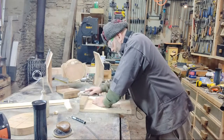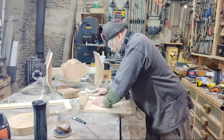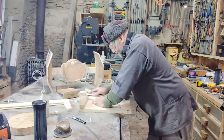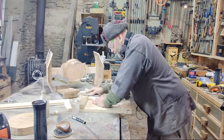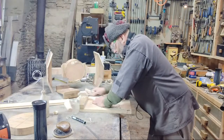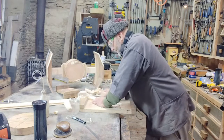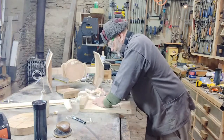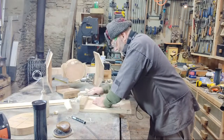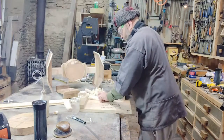I had to completely rebuild it because it was all rusty and the old handles had split and were wobbling about all over the place. So I machined up some extra little bits for it, like screw threads and stuff like that, and made new handles and milled the bottom again, the other sole plate. It's a lovely plane, eh? You'd have to pay a lot of money to get an equivalent plane today, the likes of Lie-Nielsen and stuff like that, which would cost a lot of money.